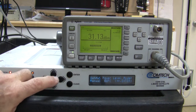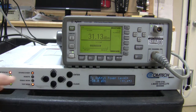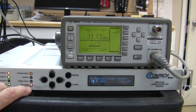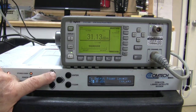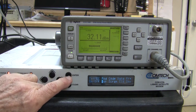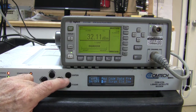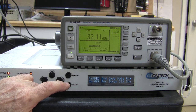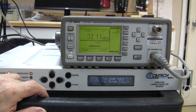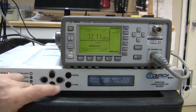Let's look at the modem. The input is currently at minus 30 dBm — negative 30 — with 30 dBm of attenuation. I'm going to increase power from minus 30 to minus 29 by pressing the up arrow and entering. Now we're seeing a change on the power meter — it's going up to 1.39 watts. I'm going to move it in larger increments because I already know this amplifier is going to top out somewhere in the 5.5 watt range, so I'll take much larger leaps.